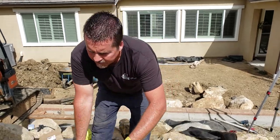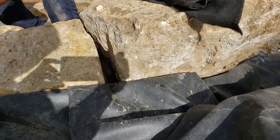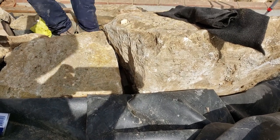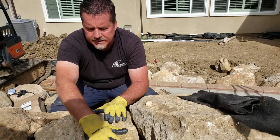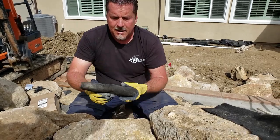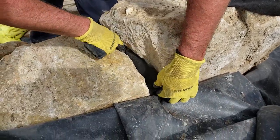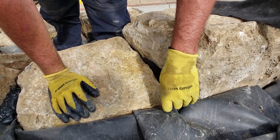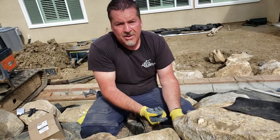This one's a couple months old. But here's the real tip: if you look down here, I've got a decent-sized gap that I need to fill. One way to fill a gap of this size is to just start foaming, but the problem is you'll see that foam from the front of the waterfall, and we don't want that. Right now this rock is leveled off perfectly — it's going to make a really good spillway stone. So what I like to do is take a piece of leftover underlayment, fold it up nicely, and gently tuck it into that spot. Then I can still foam this in and get a really good foam seal all the way around and into this crack, but it's not visible underneath where the crack is.